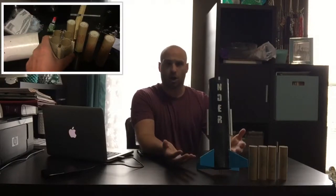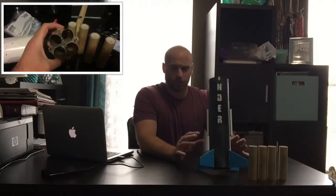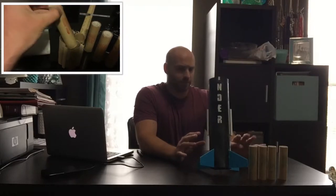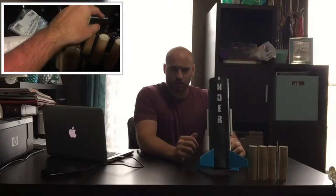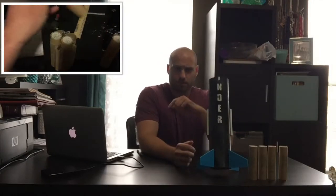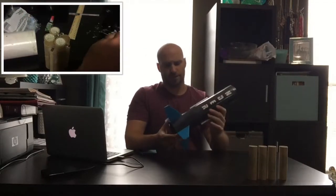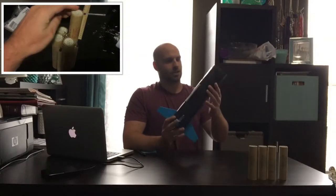This is the first stage — what's going to deadlift the Sidewinder rocket off the launch pad. The entire rocket weighs about two and a half pounds fully loaded with rocket engines, Neil Armstrong, and everything, which is why I need four F engines. These four engines can deadlift a rocket weighing about three and a half pounds max, so we have some wiggle room. I'll be showing you pictures in the corner as I talk about this. It has four fins and two launch lugs along the sides.